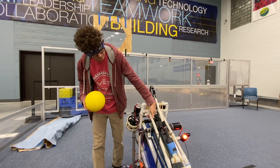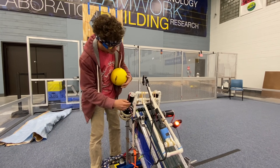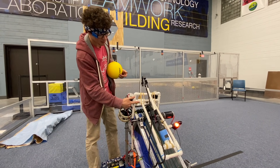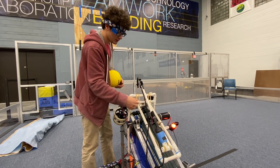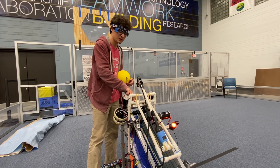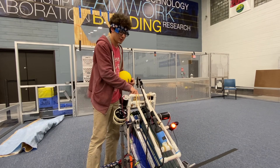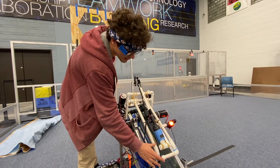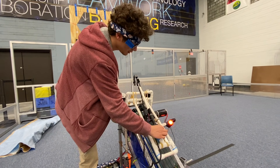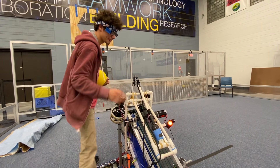Starting off, we have a PVC support here, just zip tied to the robot. We have two bars here — one to pivot on and one's the hard stop. These tees here are going from three-quarter inch PVC down to half inch, so it can pivot on this. Then we have the same setup down here with another three-quarter to half inch for this hook here to hold it down.